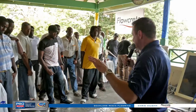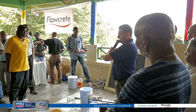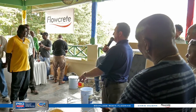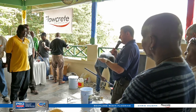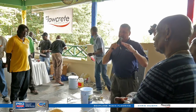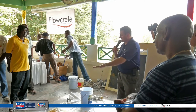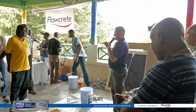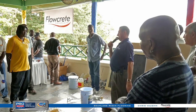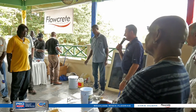There is another version — you can see a sample on the desk — that will self-level completely; you won't see any rocks or aggregate. You lose a little bit of impact resistance and heat resistance — some of what the fillers help to do — but yes, we do have totally smooth floors. In a bakery I'd do that type of floor; in a meat factory I'd go back to this kind of floor. It depends on the environment.